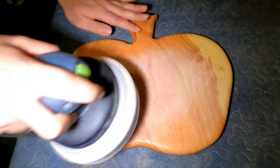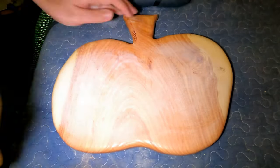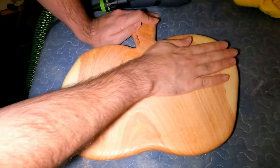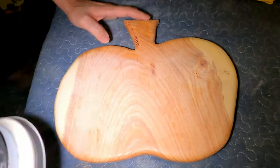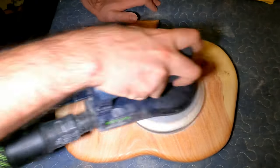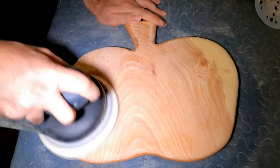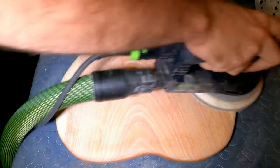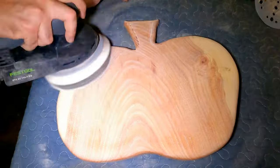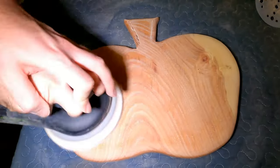This is a clip you see here, which is not part of the shorter videos. I got so frustrated with this Osmo oil, I sanded it off on top. On the bottom, it was acceptable. After sanding everything from 150 to 400 grit again, I proceeded to give Osmo oil another shot. Again, I was very unsatisfied with the results. I might not be using it in the future anymore, but it is what it is — I was done with this board.